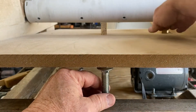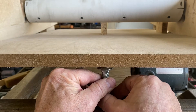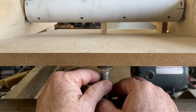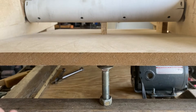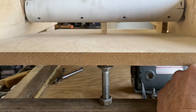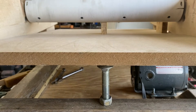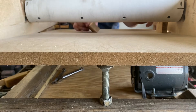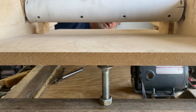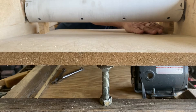I've got a shim right in the middle — there's a little gap — I'm going to bring the middle up until the gap is gone. All right, no gap. I've got my side stabilizers and I'm going to bring those up until they touch. All right, both of these pieces of wood are the same thickness. This side's touching, this side needs to go down just a hair.